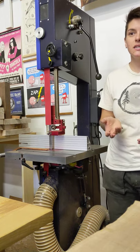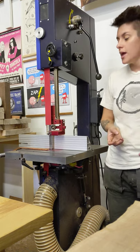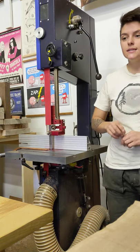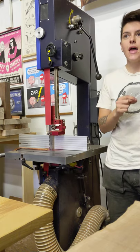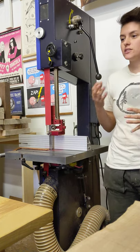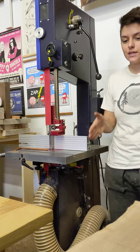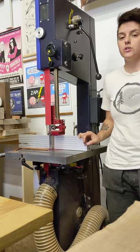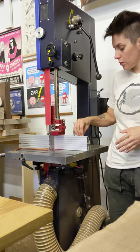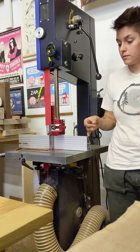The 240 volt power actually cuts down on your energy usage, which is really cool. It also comes with a three-quarter inch blade. The teeth are a little bit wider than some other blade options — the Laguna blade I've used is a little bit narrower. That's something to be aware of when re-sawing: give yourself a little more room between where you re-saw and your finished width. It also comes with a really nice re-saw fence.